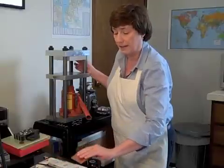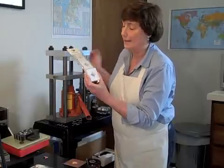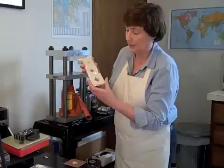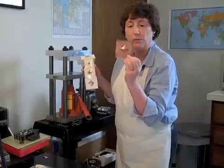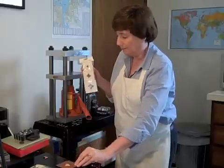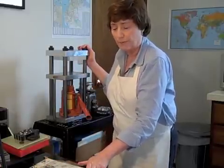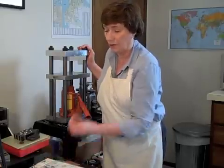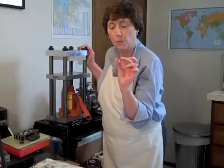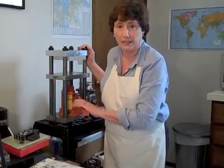On my website, I have five sets of different shapes of acrylic matrix dies. These are actually Lexan plastic, which is a polycarbonate — very strong — and they can produce a three-dimensional form in the metal. A lot of people have emailed me asking why there are no round matrix dies, so today I thought it would be a good idea to demonstrate how to make a round form using a circle cutter with the hydraulic press and a dapping block with the hydraulic press.